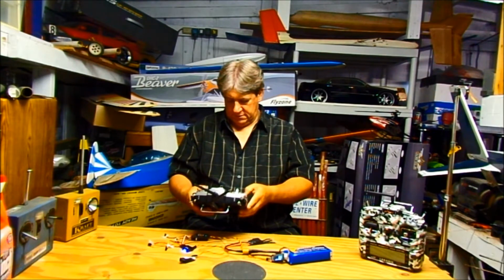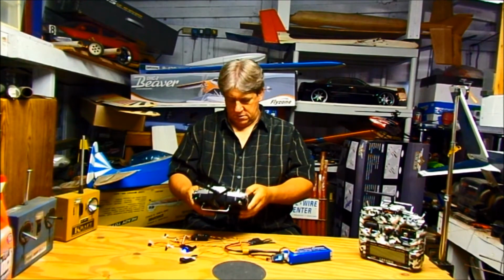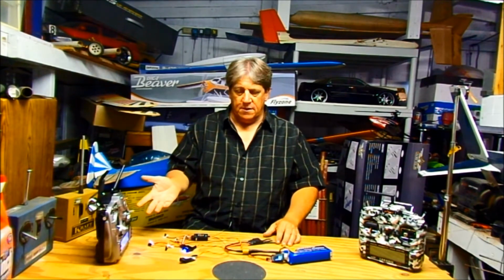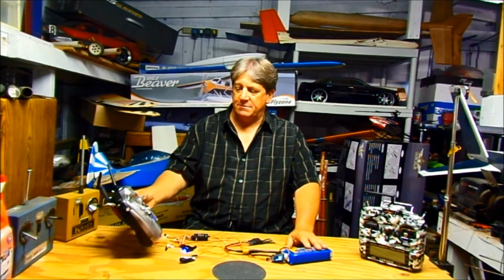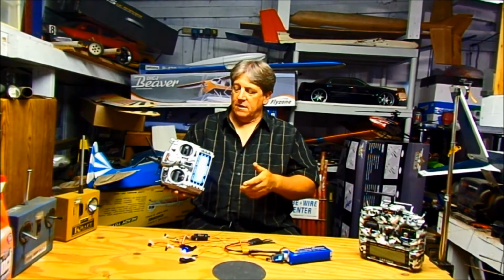11.4 volts. And let's go up here. And we'll activate this one too. 3.8 volts. Okay. So what I did is I just upped the voltages so that the pack voltage is lower than 11.8, I think I set it at. And the single cell I set at 3.8 volts. So now I'm getting both notifications. I'm getting my single cell notification, and I'm getting my pack voltage notification.